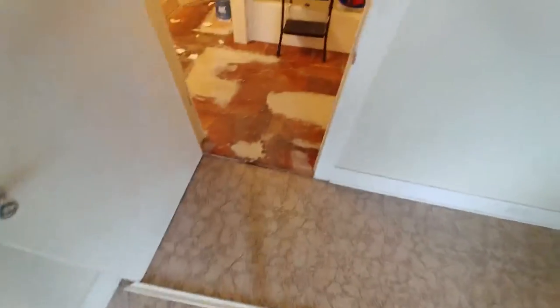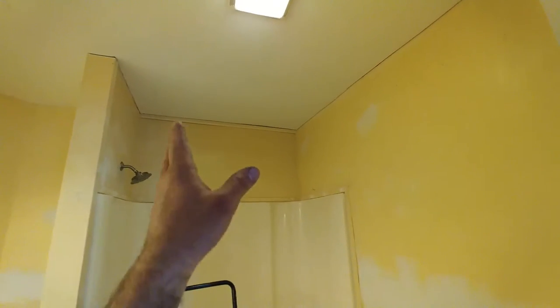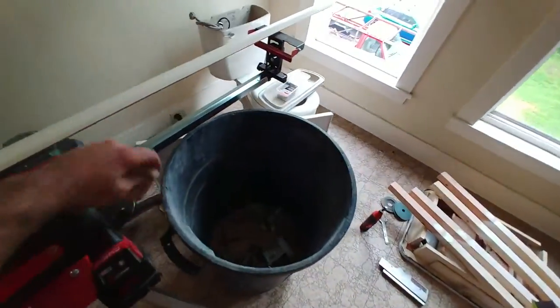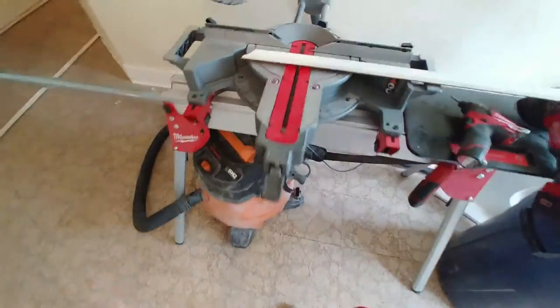We're going to work with this — I just cleaned it and we'll call it painted. If I need to touch it up I'll do a paint match. What we're going to do is flat-cut ends and cope pieces in between, rather than put miters on it. You pick walls to flat-cut the ends on, and the adjacent wall gets a piece with a flat-cut end, and then I'll cope both ends of the piece that jumps between them. Here's a cope — you'll notice how they differ.